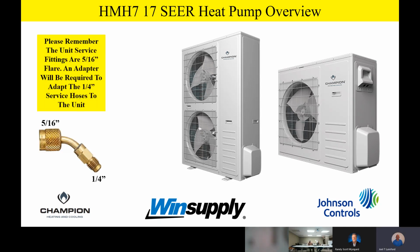The first thing I always like to remind everybody, even though the HMH7 is not a mini split, let me stress that one more time. It is not a mini split. It kind of looks like one. But you're going to hook it up just like you would a normal heat pump as far as your line set. It takes a conventional air handler or coil inside with just a conventional expansion valve. So again, even though it kind of looks like a mini split, it is not a mini split. It has a suction line and a liquid line just like any other heat pump.